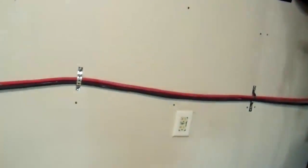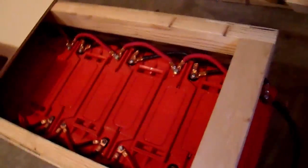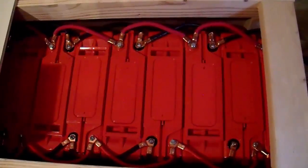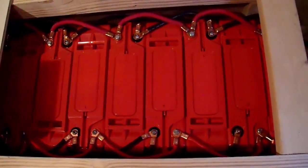Here we are in my basement. I have a split foyer, so the cable runs in here, down through another quick disconnect, and into my battery bank. This way I can safely disconnect on either side without any risk of shorting something. I also have it running through a fuse — good practice. And then my battery bank: I have a video series on this as well. I believe it's 12 industrial batteries that I was lucky enough to get in good condition as salvage equipment.